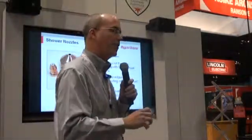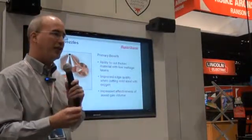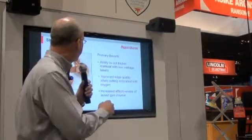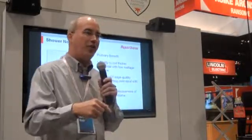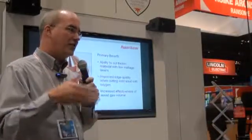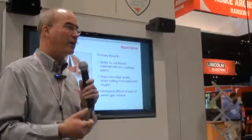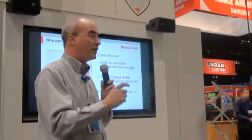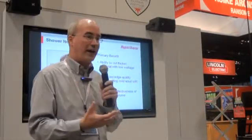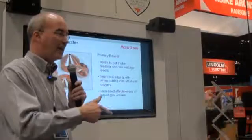Next would be a shower nozzle — just like the name implies, it looks just like a shower head. In oxygen cutting at low pressure, you're using these actual shower jets to force oxygen into the kerf of the cut. By forcing the oxygen into the kerf, it allows you to cut thicker material. For a lower-power CO2 laser, around two kilowatts, it's going to allow you to cut thicker material than the specifications normally allow. Additionally, it increases the exothermic reaction between the oxygen and the cut, which increases the speed of your cut.